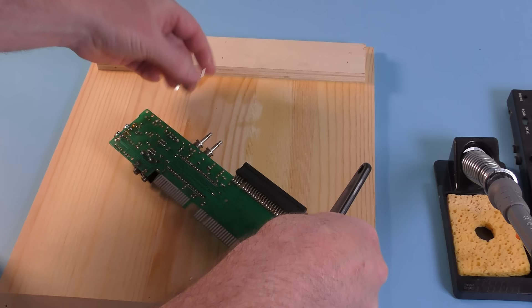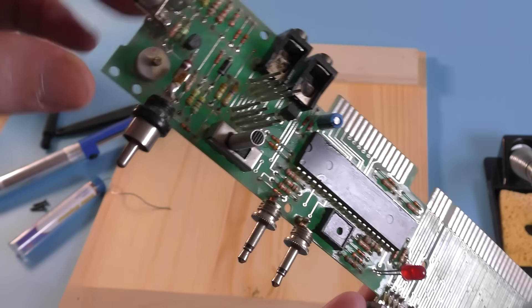Opening it up, the RF socket was a real mess. Not only had it come loose from the circuit board, but the connecting wire was snapped. The RF socket is used to feed the composite output, so I refixed the socket and wire — it was still a bit delicate, but we'll come to that later.